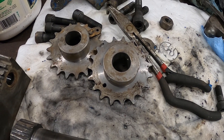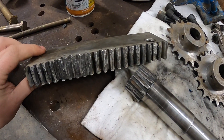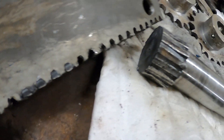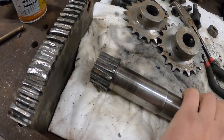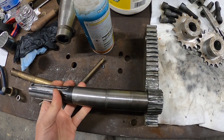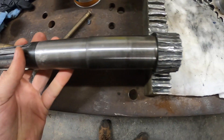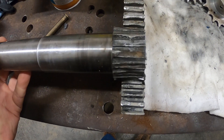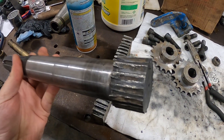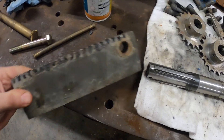These are the relay gears that hold the chains that lift the head, and this is our rack gear — what's left of it. You can actually still see some teeth stripped off the pinion here. That's what would have driven this. If we're looking from behind the head, the white sheet here represents the head, the pinion goes into the feed box whether it's being hand-operated or power-fed, and then this pinion drives the rack. This pinion has seen better days. Hopefully this explains the issue I've got.